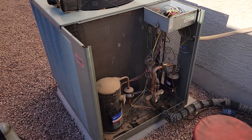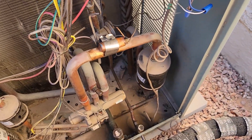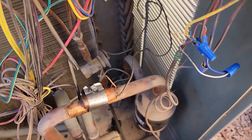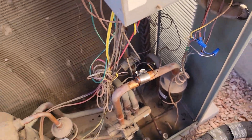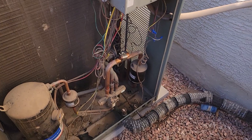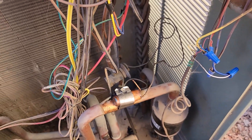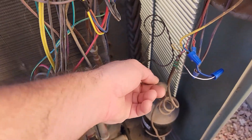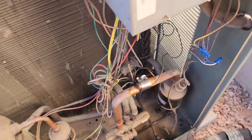I am back today, like a week later. I'm going to pull the charge down to near zero — I'm going to leave it slightly positive so I can take that power dome off the TXV there. Hopefully that's all that's wrong with it. I've seen that there's a bi-flow for cooling mode and cooling works fine. I'm not thinking it's a plugged strainer or anything like that — I'm just hoping that this dome lost its charge, which I will cut it momentarily. Let's see if it did.